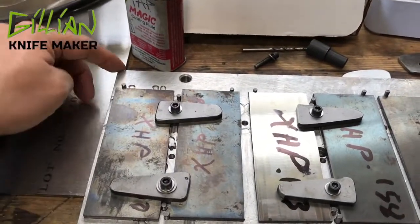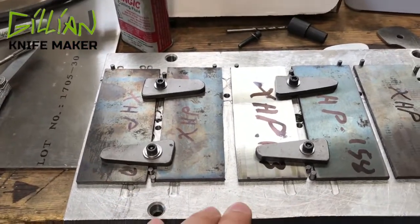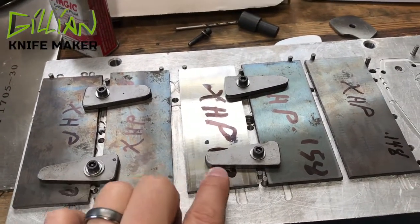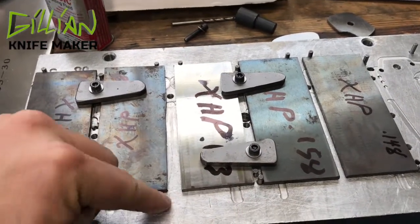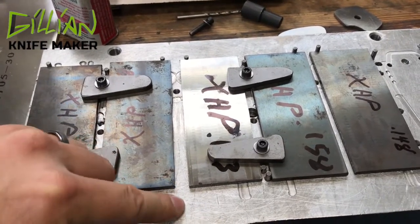I set this top corner as my G54 and I used the top of the fixture as my G54 zero in the z-axis. So even though you have various thicknesses of bar stock, it shouldn't affect the programming because your G54 zero is the top of the aluminum jig.